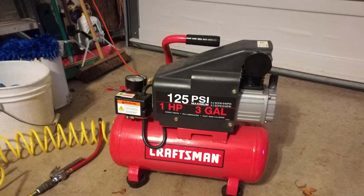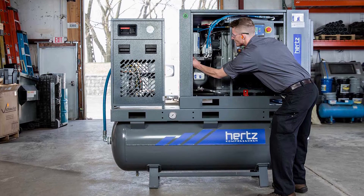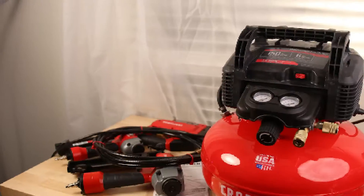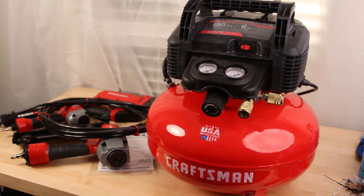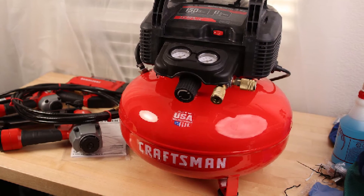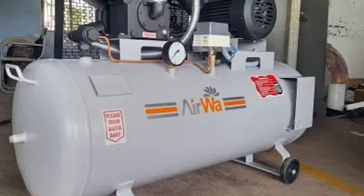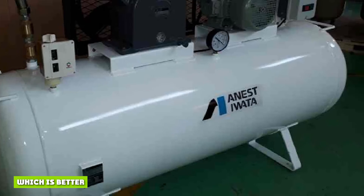The pistons used in a reciprocating air compressor are no different to those used in an internal combustion engine, like the engine in your car — the pistons need lubrication. The major difference is that temperatures are lower in an air compressor because there is no combustion of gas. While air compressors run cooler than a gas engine, there is still heat generated by the friction between the piston and the sleeve in which it moves. To reduce this friction, a method of lubrication is needed.